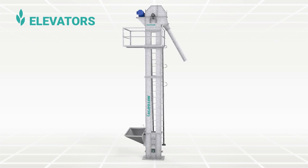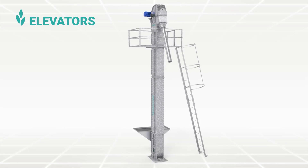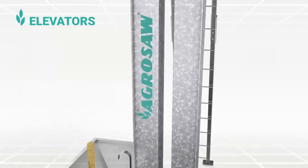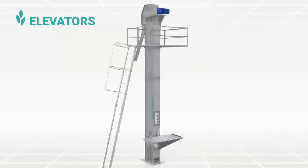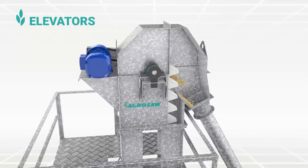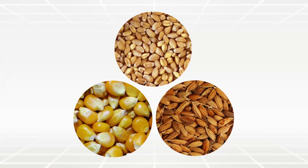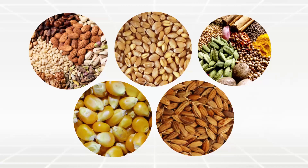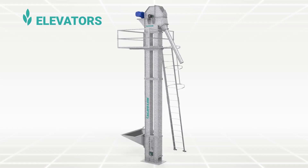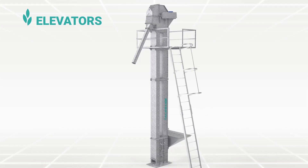A vertical bucket elevator is a kind of conveying machine that uses a series of buckets uniformly fixed on a belt, which runs in a vertical direction over top and bottom pulleys, for continuously lifting of bulk materials. Bucket elevators are widely used in food and agriculture industries to lift bulk and granular materials like wheat, maize, paddy, nuts, spices and many more. Agrosoft elevators are ready-to-use type, designed for the gentle handling of material and have a long, rugged service life.